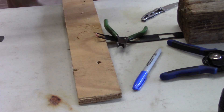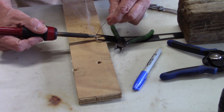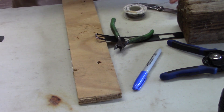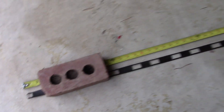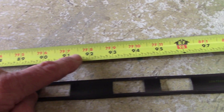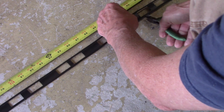First thing I'm going to do is solder the shorted end before I stretch it out, because it's seven foot nine inches to the shorted area at the bottom. The directions say cut the matching stub seven foot nine inches from the shorted end. I've already soldered up the shorted end. I've got it laid down on my shop floor so we can keep it flat and very accurate — seven foot nine inches. I'm going to add just a quarter of an inch to help me fold over the wire.